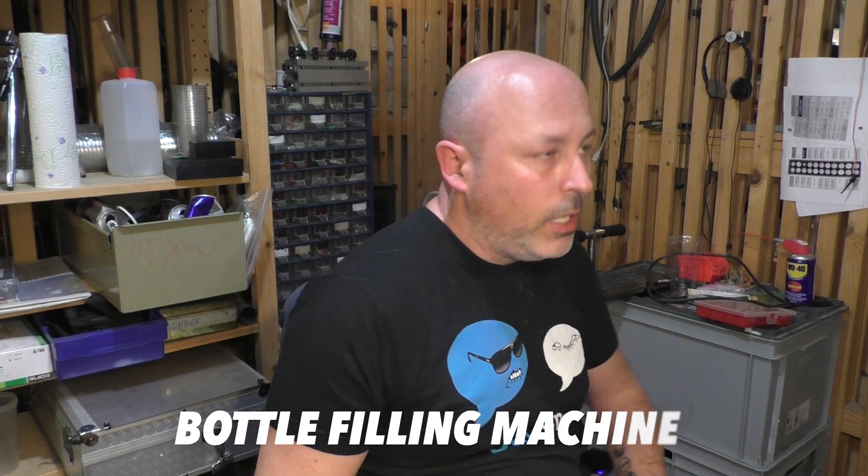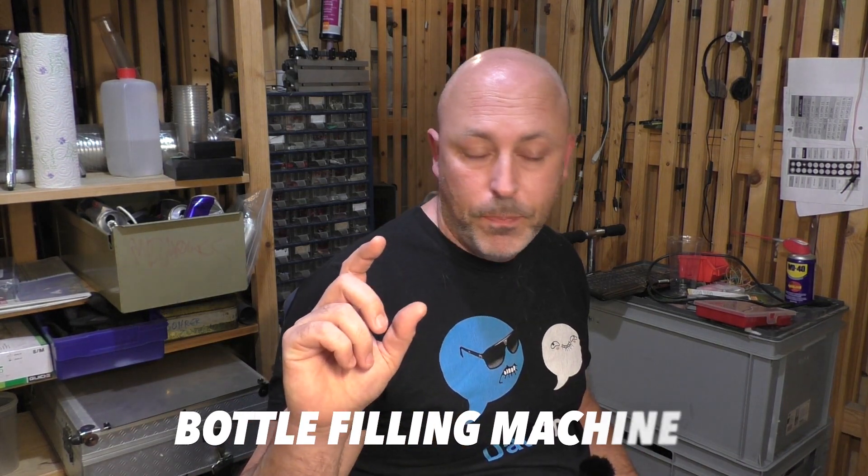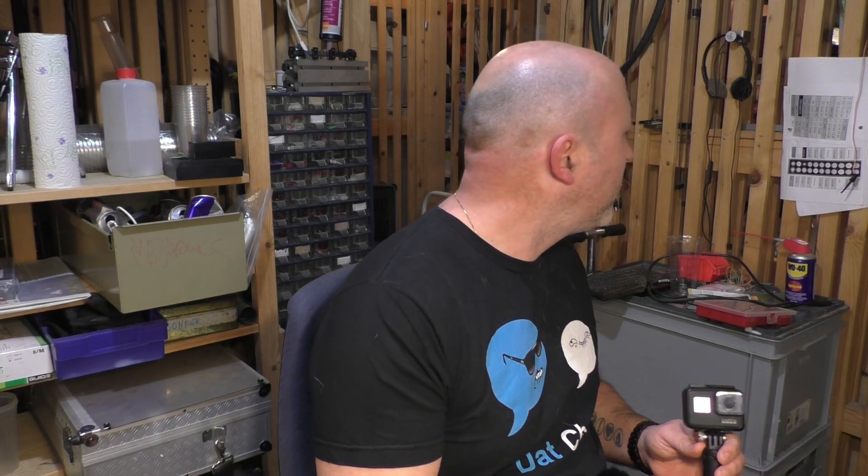I'm back with the bottle filling machine for the little bottles. I had to realize, while the software was more or less finished, that the temperature sensor and the safety thermostats are in the wrong place — they are on the hot side of the heater and not on the side where the water flows. I underestimated the temperature difference between the hot side and the colder water side. In hindsight, politely said, not so smart — but that's how you learn, right?